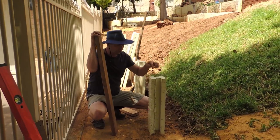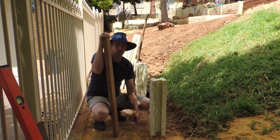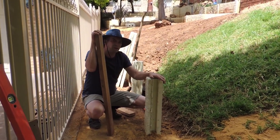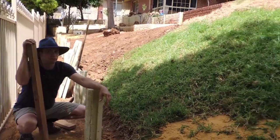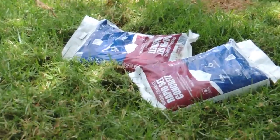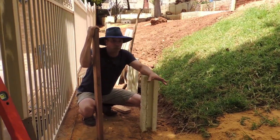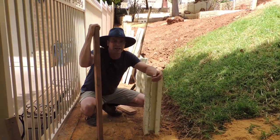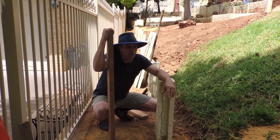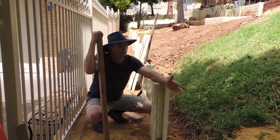In the process of a 600mm high wall you need a 1.2-metre post. It's always double — if it's 1.2 metres high you'll need a 2.4-metre long post. It'll need to go into the ground with about one and a half bags of rapid set 20-kilo. If you're going more than that, you'd want at least two bags depending on your soil type. If you've got really soft loamy grey sandy dirt that's very loose and soft, definitely use two bags — that soil tends to move with the flow of water and can undermine.